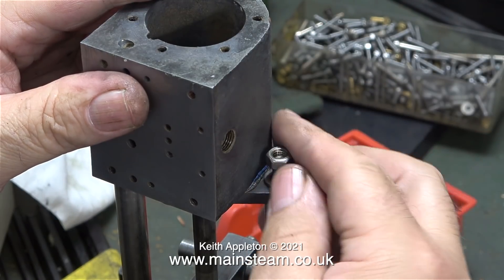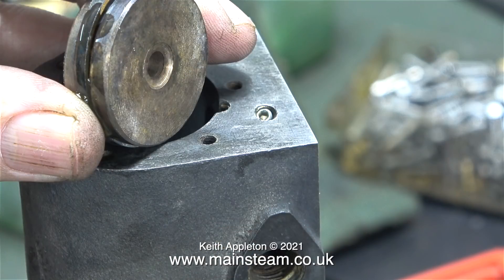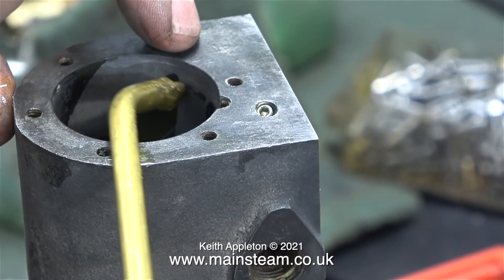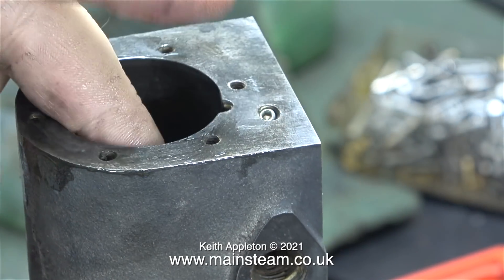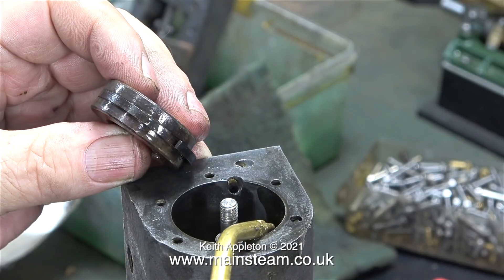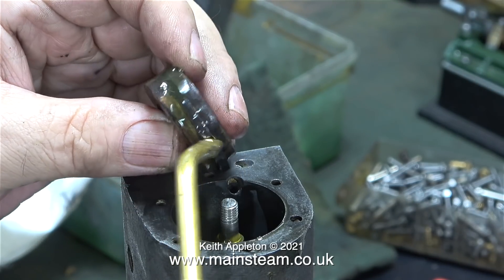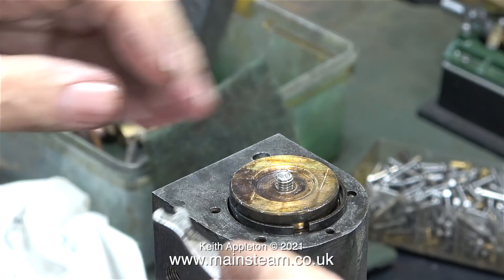In this clip, I'm refitting the steam cylinder to the two columns. There is some inaccuracy in the length of the columns where they support the cylinder, and there is a thin washer fitted underneath the cylinder casting on one of the columns. When I tried the piston in place once I'd mounted the cylinder to the top of the columns, it wasn't a good fit — it was very tight. So I removed the cylinder, swapped the packing washer over, and now, with the cylinder more in line with the columns, I'm fitting the piston.